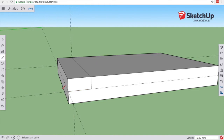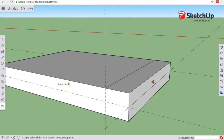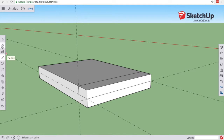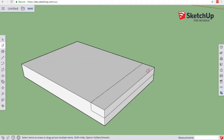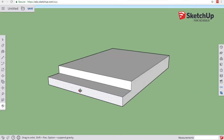I'm going to end up tracing each of these construction lines — very much like I would be doing with rulers, squares, and pencils on the real wood. I'm essentially getting all those lines in there, and finally I'm going to rub out all these extra construction lines that I don't actually need. I now have this piece measured in: 12 millimeters from the end, six millimeters down, and all the way around. In the simulation, we're going to use the push-pull tool and go down six millimeters to that line, and we now have our rebate.